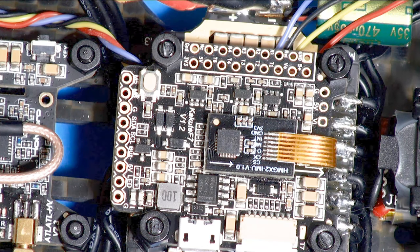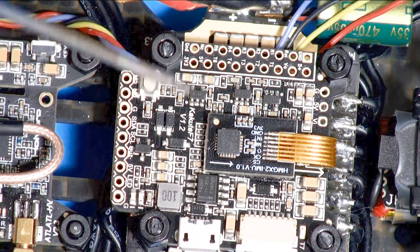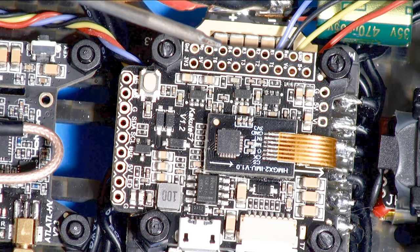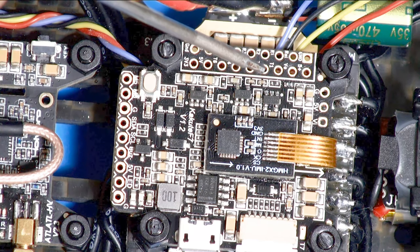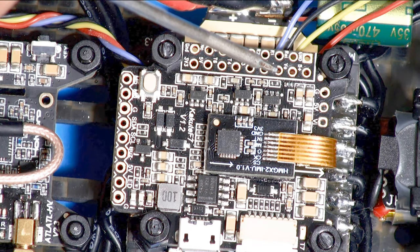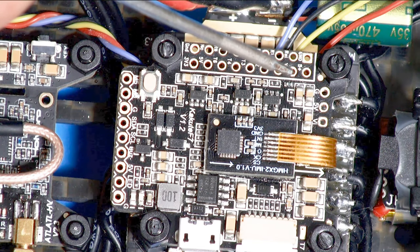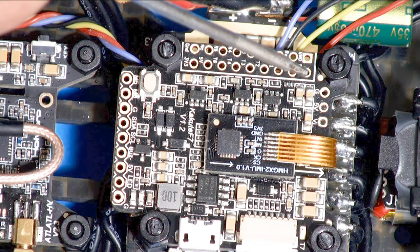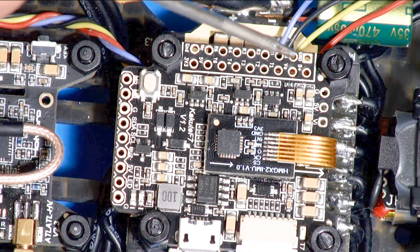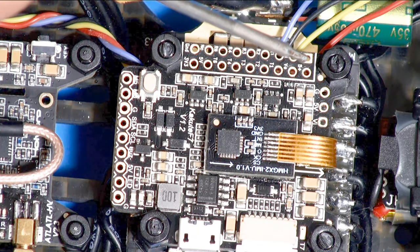To start out with, I know that smart audio goes to UART 1, so that means the TX pin of UART 1 — T1 — right here. Actually it's going to be this one because the legend is below the hole. So right in this little corner I have the blue wire from the video transmitter, video out which goes to the yellow wire, I have B+ which is the red wire, and over here in this corner I have ground. These four, grouped nicely, all power the VTX. So we're going to go ahead and solder them up.